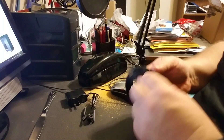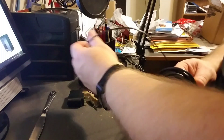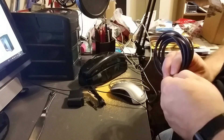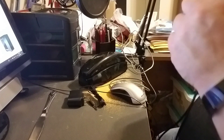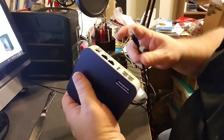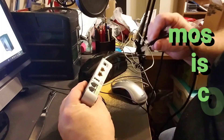Hardware connection is pretty simple. You can see cables strung everywhere — this is an office being moved to a space currently being remodeled, so nothing is neatly done right now. The included cable is just over six feet of category 5 cable — not even 5E — so it's not capable of gigabit. But then again, this device only communicates at 10/100, so make sure your router or switch talks at 10/100.